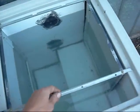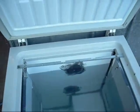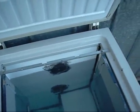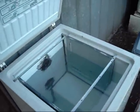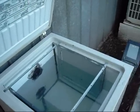This is very similar. Electrolysis, or electrolytic rust removal, is pretty much the same thing. There's a sacrificial anode, and the piece with the negative DC charge is actually protected and cleaned at the same time, so it works quite well. Let's hook up some power. I'll get the power supply out and wire that up.